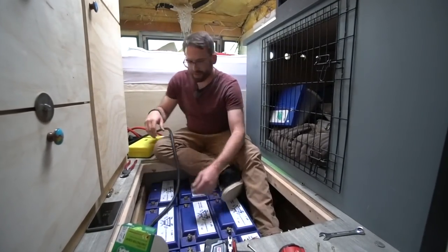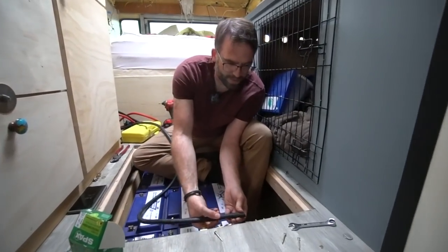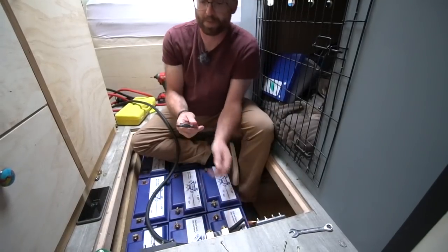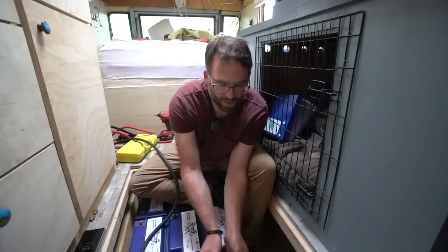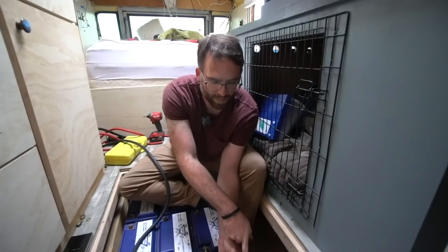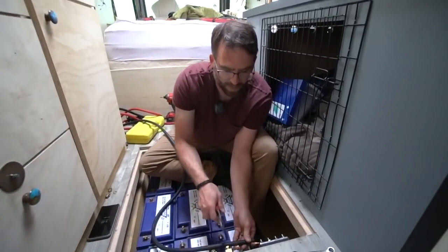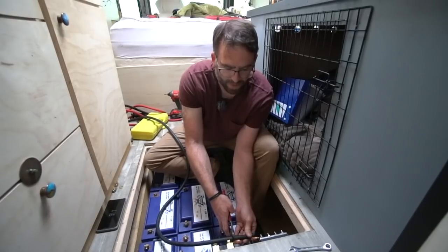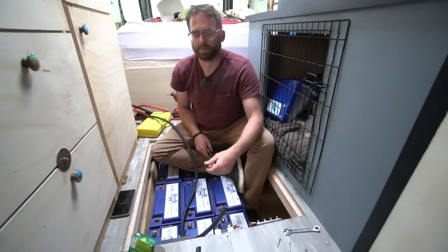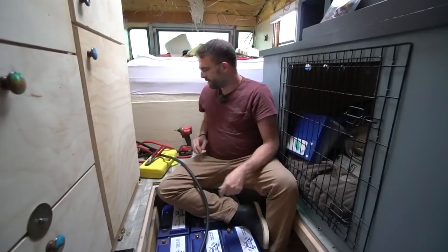So I'm going to get to measuring and cutting cables. I sort of eyeball how long it's going to be and look at the other end. These particular shears are really great. You want to eyeball your wire, measure it if you want. I just look at it and want to be able to poke the copper all the way up into where the crimp starts on these connectors. So I'll cut this cable right there — that gives me just that little bit of space. It's really easy to cut the stuff. Don't screw around with sawing or razor blades — you'll wreck it.